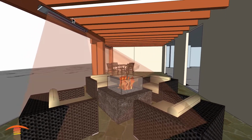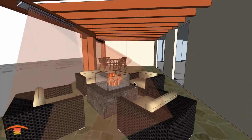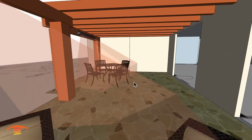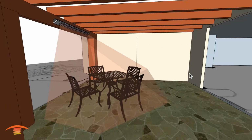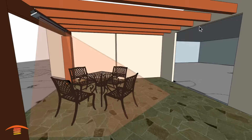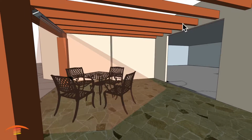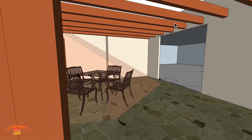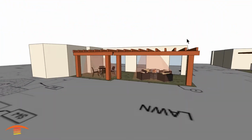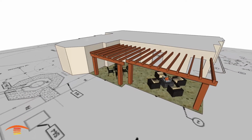Now if you could take another unit and put it against this wall and cast that beam this direction, then I think it'd be a fine application. And then the same really applies to this as well. However, you've got a window, actually it's a doorway here, but I don't think you can put a unit over here and have it cast out a beam out to here without minimizing or going against the clearance to combustible issue. So I'm not going to recommend that. And let me just, 1 second. I'm going to go ahead and turn that off right now.